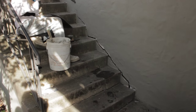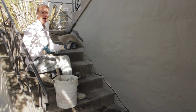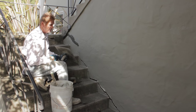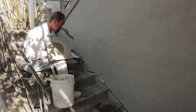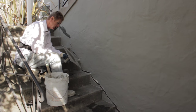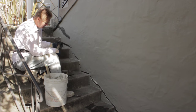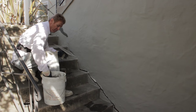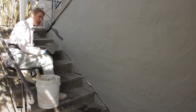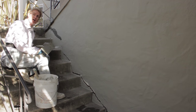We've got a big tree right here on a hill with a lot of seasons of rain. Rain will lift a house, drop it. After 90 seasons, you get this kind of stuff - it's actually quite typical. These cracks right here are so large that caulking won't work - not even any of the caulkings I've shown in the past five or six hundred videos, because they're made specifically for three-eighths of an inch wide and possibly deep. These are almost a half inch - that's why I went to the polybond. Use your jet stream on your water hose and get all the dust, dirt, and grime because even the stuff I'm going to bring won't adhere to it.